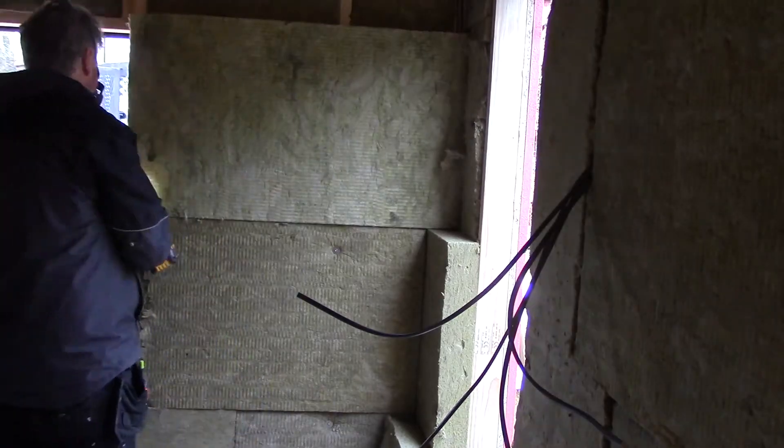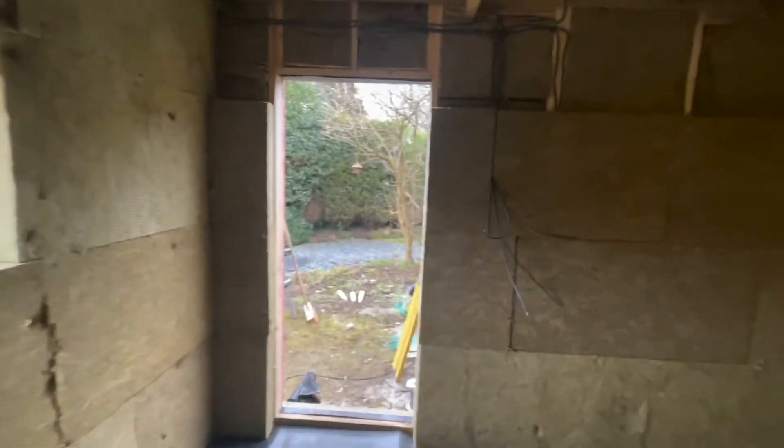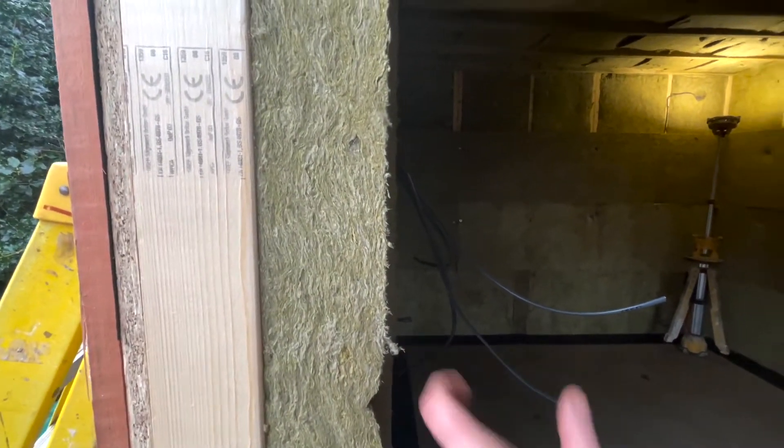That's all the electrics in and the second layer of insulation. There are a few bits missing at the top — we've also got the first layer of insulation in the roof, and damp proof membrane across the bottom, secured in with screws and washers. It's starting to get a bit thicker; the inner shell will go here. If you're doing your own soundproofing project and need a little more advice, we offer a one-hour consultation service — click the link in the description. We're just about to bond the roof on but there's a little bit of water on top so we need to dry that off first before we roll it back and get the adhesive on.